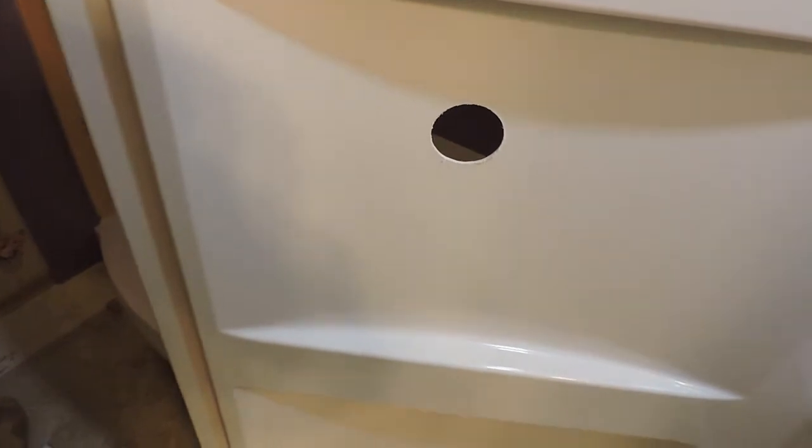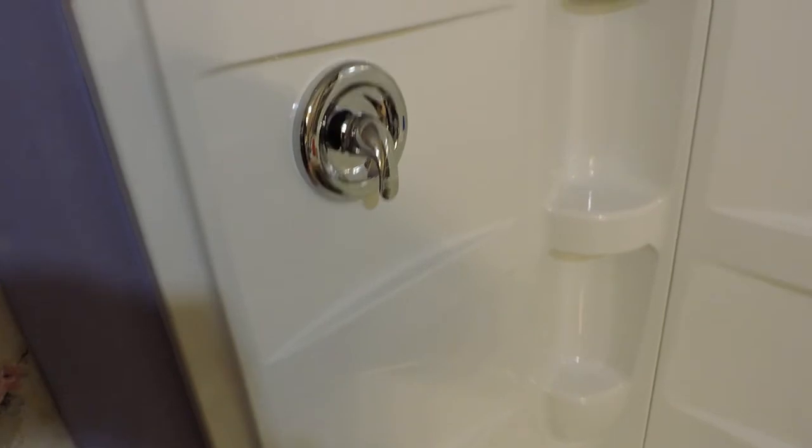So it's in one piece. I measured my distance and drilled with my hole saw for the faucet. As you can see, the base does have a lip on it, so if I put a heavy bead of silicone along the inside of that lip and then set the walls on the base, it's not going anywhere. There's also a little lip on the bottom of the wall pieces. Everything will be waterproof and secure — it won't come loose or crack. Once I get it all in, that's the plan.